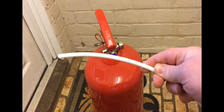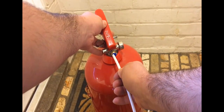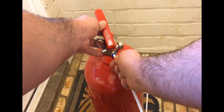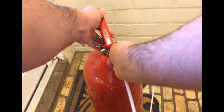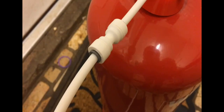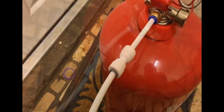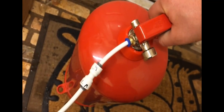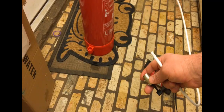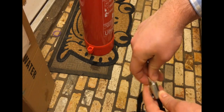Now you can insert your hose. You'll want one small 10cm piece of tubing to connect to your check valve fitting. This prevents air or water going the opposite way to where you want it, so point the arrow towards the extinguisher since we are adding gas in to re-pressurise it. Continuously squeeze the trigger, which will open up the cylinder so you can pump air into it. Once you've reached the desired pressure, let go and this will block off the cylinder and shut in the pressure.